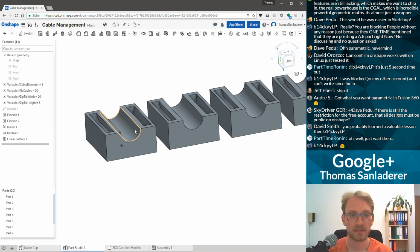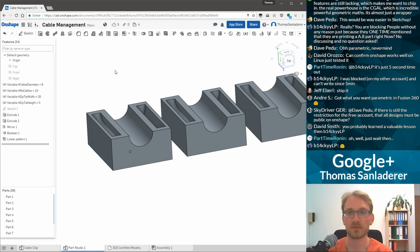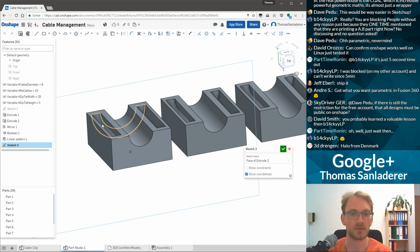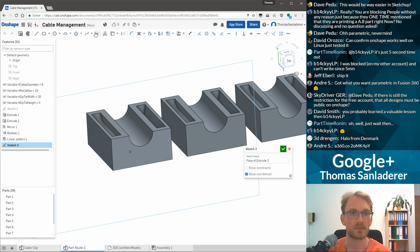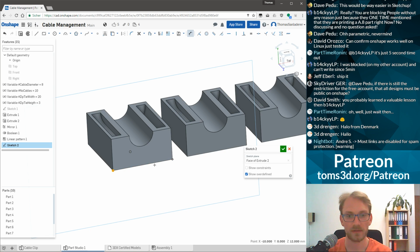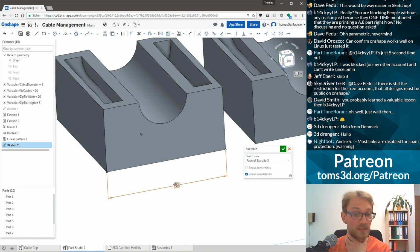I think we can actually go into the, no, it's actually relatively simple math. So if you look at the width of this part, can we dimension in here? We can always grab a sketch. So the width of these parts right now is, this is going to turn gray, I hope, 20. Yeah, 20, because this isn't a dimension we can change, because this is directly taken off of the width of this part. So 20mm it is.